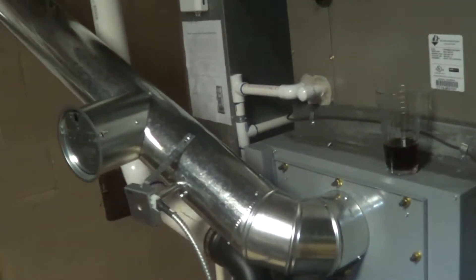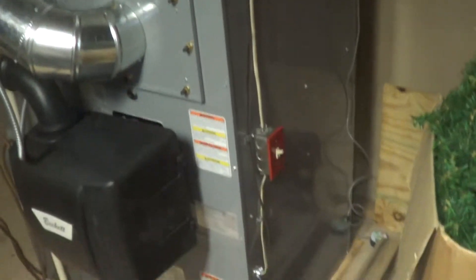There's the evaporator and the humidifier. I like to put wet switches as a lockout on the humidifier, but I don't shut down the furnace because I don't want a nuisance trip of the furnace shutting down. If there's water dripping, it'll just shut down the humidifier.